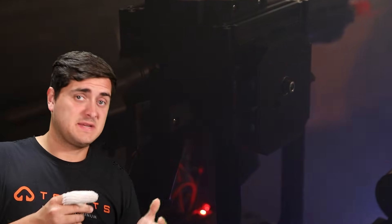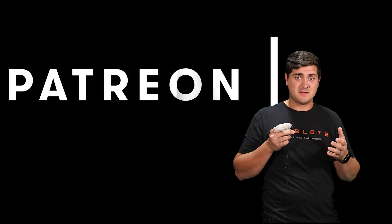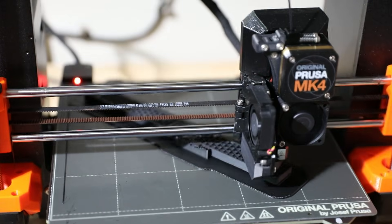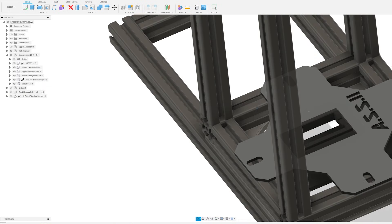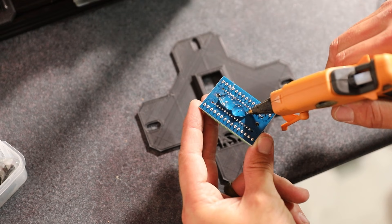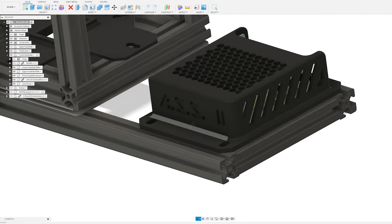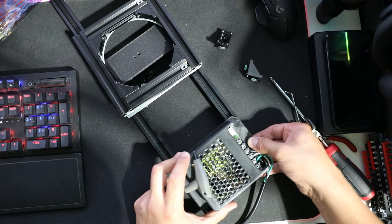Unlike last time, I actually want to make this one available so you guys can build it if you want. I've had a lot of people wanting me to send them my code and all that — stick around for later in the video. This time I used black aluminum extrusion with a similar shape to the previous frame. On my Prusa Mark 4 3D printer I printed out PLA plates that sit on the bottom and top of the base. These attach to the servo on the yaw axis to turn it side to side. On the uprights I designed brackets to hold up the blocks that house the bearings for the pitch servo. I also used an Arduino Nano to save space on the base plate, as well as a dedicated power supply, because with three 35-kilogram servos I needed a higher amperage output than the Arduino itself could provide.